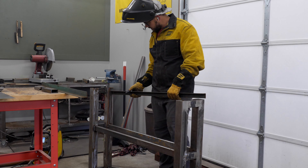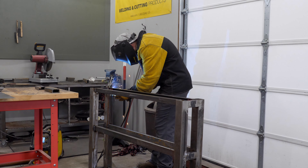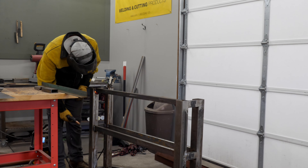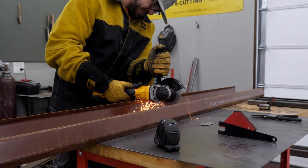After the legs were together in two sections, I welded up the long pieces on the two bottom shelves. That tubing is 1-inch by 2-inch, 14-gauge. I welded that up so it was all secure, and then I moved on to the top shelf. For the top shelf I'm using just angle iron, welded to the sides, because I don't need heavy tubing there — I'm going to use a wood top, and it's only going to hold four medicine balls.